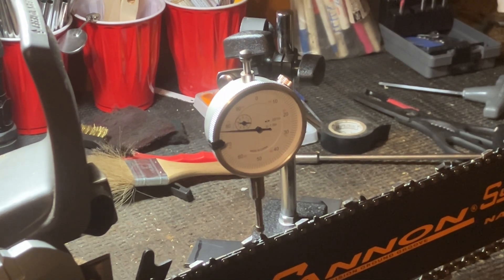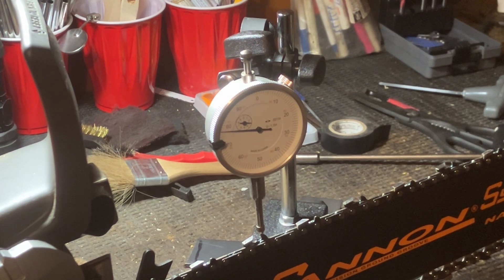That seemed to work halfway decent. When I was cutting with it compared to off-the-roll chain - I think the off-the-roll chains are at like sixteen or seventeen thousandths, so this has a couple more swipes off the raker. The difference in cut speed was nothing, but it just seemed like it lugged the motor down a little bit. Maybe I'll try twenty-five thousandths with this and see what we come up with - maybe I'll pick up a little speed. We'll see.